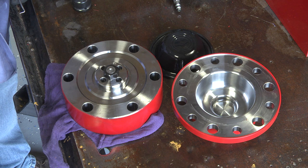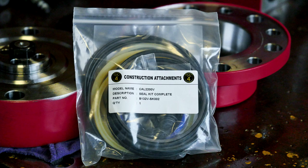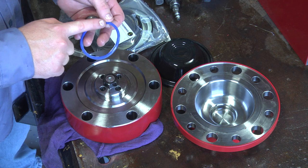This is a complete seal kit that should have every o-ring and seal that you need to completely rebuild your hydraulic breaker. When you go to replace the new seal on the bottom of the accumulator, it helps to add some grease in order for it to stick once you turn it back over so the seal does not get pinched.